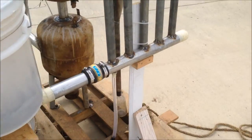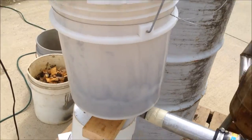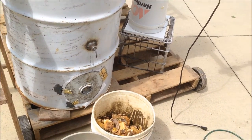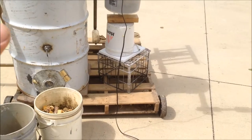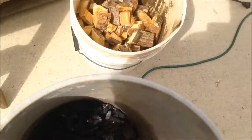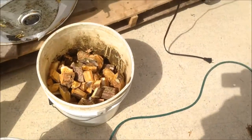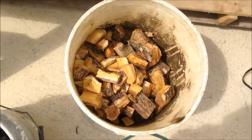This is not my completed system at all. The ends are taped up with plastic, my filter isn't the filter I'm going to use, the blower is not the final blower, and the shaker grate in there is still an aluminum pot, not a stainless steel pot. With all that said, we're still going to find out if I can make some burnable gas. I'm going to start with some biochar from my old gasifier and then use some Osage orange chunks I chopped up for the smaller reduction zone.